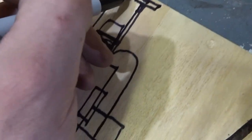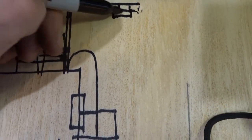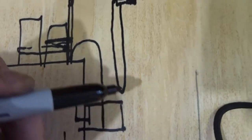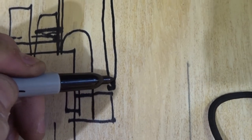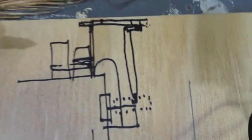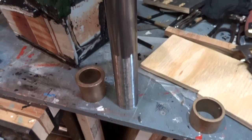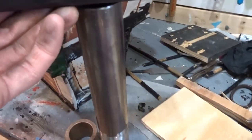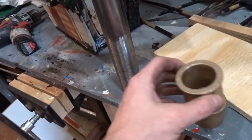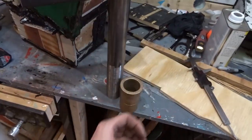And into that, we'll lock in a 7-foot long 1¾-inch square tube. Onto that goes the electric hoist, there's the motor, and the aircraft cable winch. It'll probably be doubled over like that for extra load capacity. Steel hook and clevis, all that good stuff. This will be holding some kind of dope aluminum basket that can receive 50-pound sacks of pigeon feed, 50-pound sacks of dirt, bigger sacks of dirt, shit coming down. So that'll be welded onto this pin, this long. Also pretty thick-walled, cold-rolled. This is hot-rolled mild steel. This will receive these two silicone bronze bushings. So these will go in there, and this whole thing will fit into a 7-foot-tall post.